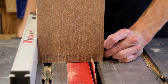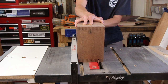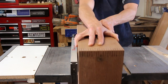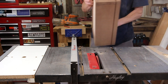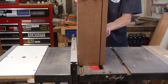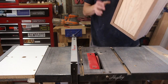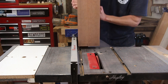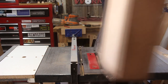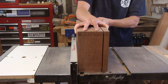My first step is to adjust the height of my blade so that it's just under the thickness of the boards. Go ahead and set your fence wherever you need to make your cut — make sure you lock it down. Fire up the saw and begin making your cuts. We're still going to pass the box along all four sides along the fence, but instead of cutting all the way through and releasing the top, we're going to leave a thin sliver of wood which will keep the top attached. As I make this last cut, the lid is still completely solid and stable and not flopping around.